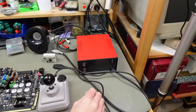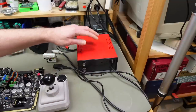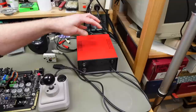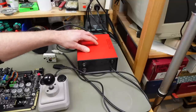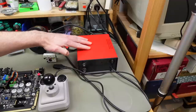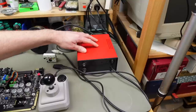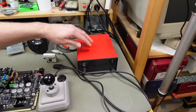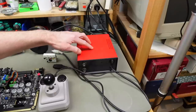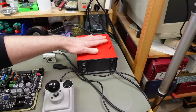And regarding power supplies, I used my self-made power supply that I made a video about a while back, which is a switching power supply for the DC part. The AC part is basically just a huge transformer directly hooked up to the AC outputs. But the DC part is a rather noisy switching power supply, and even that noisy power supply gave me some great output regarding sound and video on the EVO. So the filtering on the board works well. It's not recommended to run this on a regular C64 power supply. The original power supplies are crap anyway, frankly.